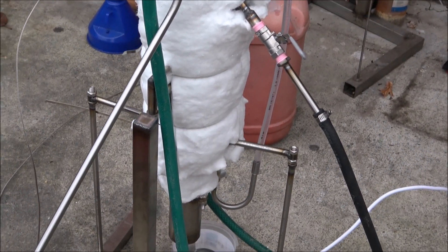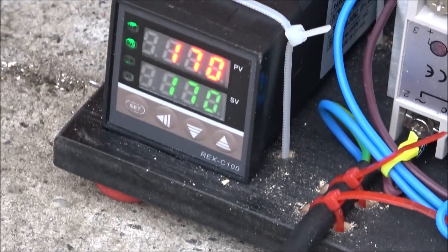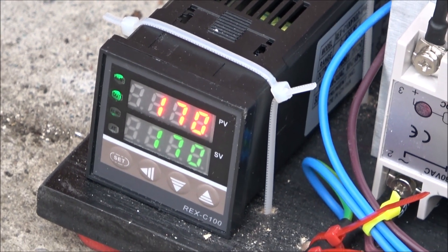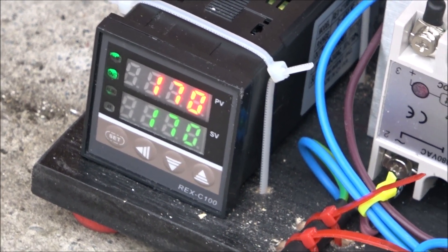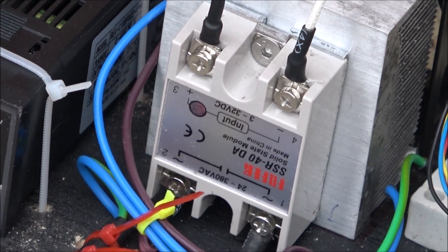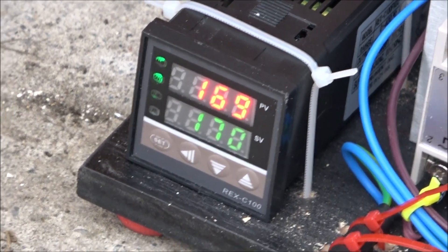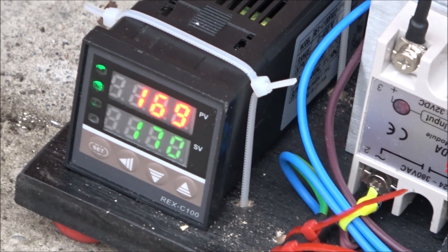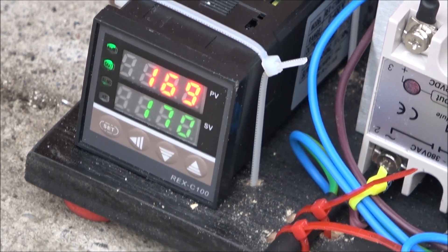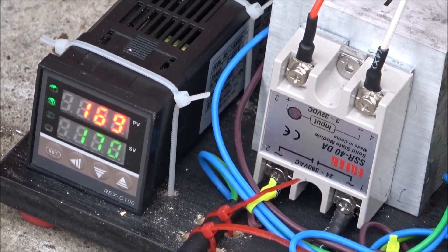The rest is done by the machine on a continuous basis. Now you can see the temperature climbed up to 170 degrees at the top, and at this stage if it gets any higher it will switch off the relay and the relay will cool it down — it will shut off the heaters. Now it's 169 again. So you can see it's cycling — it skips within this range. It can go down to 168-167 and climbs up really slowly, gets up to 170 degrees Celsius, and then it switches off by the control unit.